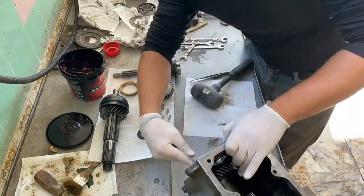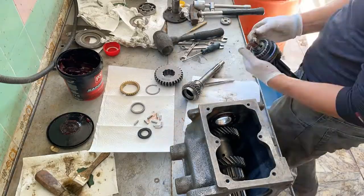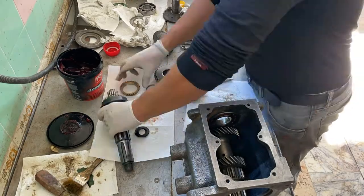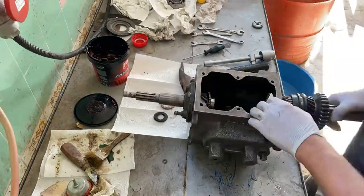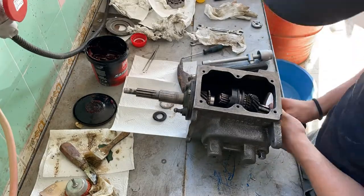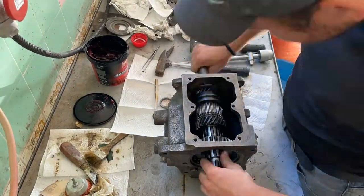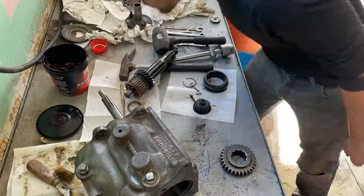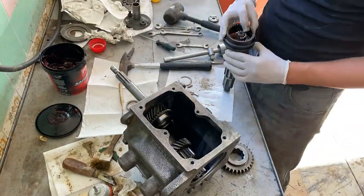As you can see, I started by cleaning the internals of the main gearbox. There were lots of roller bearings, and I took them apart, cleaned them all thoroughly in acetone and sometimes gasoline. Next I put everything back together — while doing that I used a ton of grease, simply to ensure that nothing breaks down later. The grease also helps to keep the rollers on the shaft, because otherwise they just would have fallen down.